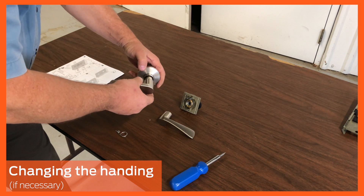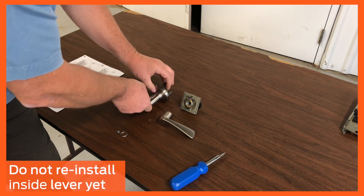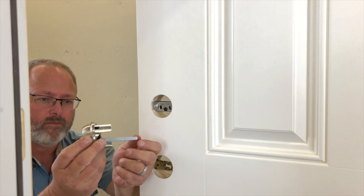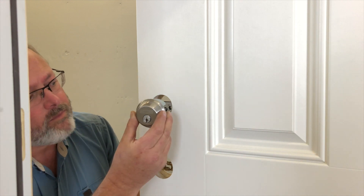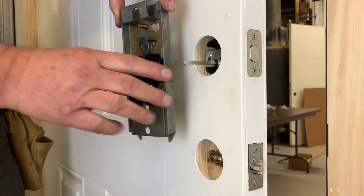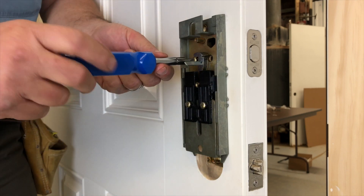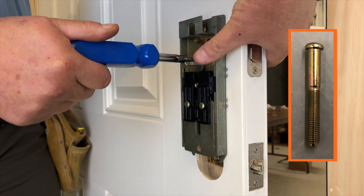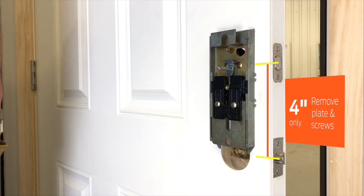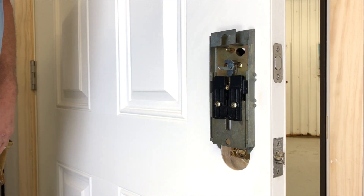Reinstall the outside lever onto the chassis by gently pressing into place until you hear a click. Do not install the inside lever yet — this will be done in a later step. Before continuing, ensure the deadbolt is retracted. With the cylinder tailpiece oriented vertically, insert the outside housing assembly through the deadbolt latch assembly. Ensure the cam of the interconnect assembly is vertical, then place the assembly onto the inside of the door, ensuring the tailpiece fits into the cam as shown. Secure with the two screws. If the distance between your horizontal face-bore center lines measured 4 inches, remove the black plastic plate and screws from the interconnect assembly. In this video, the measurement is 5½ inches, so the piece is left in place.